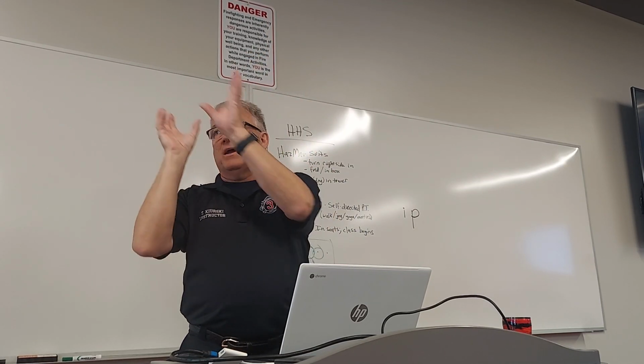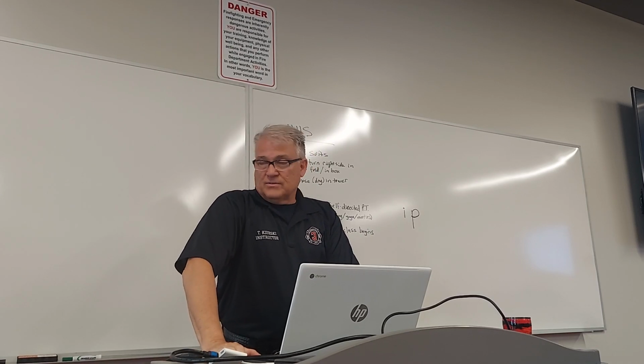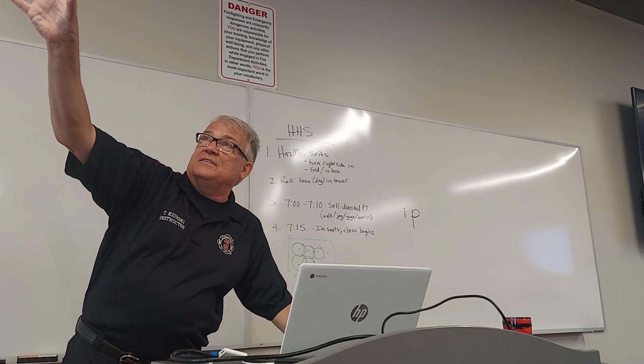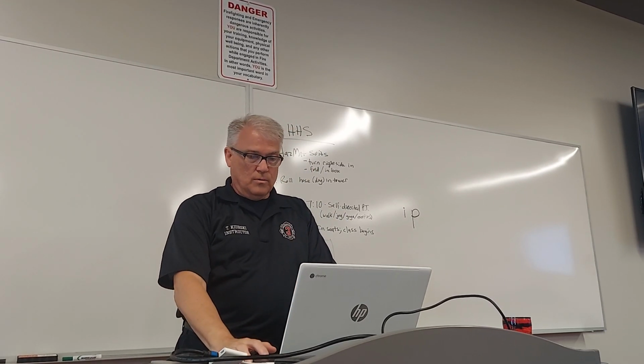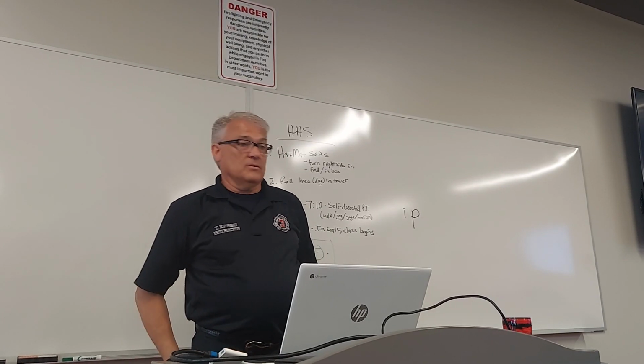But again, you might have it where it's that spot right between the 2 of them where they're both going to get enough heat and they're both going to go off. And then you have 2 sprinkler heads. That's 95% fires, 1 sprinkler head, 98, 2. So to have more than that is very unusual. And then we'll talk about the other systems a little bit later.